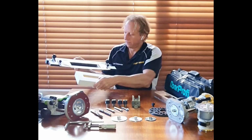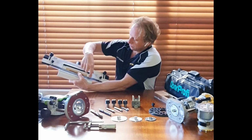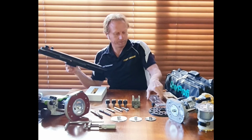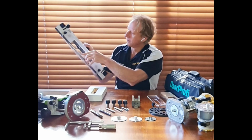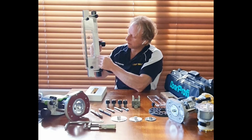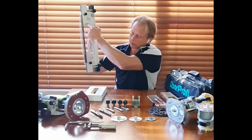Now that would go like that, and the template you use would be cut in the centre. So as an example, I don't have one here. If you're going to do the spindle holes or the cylinder hole, well, that's centre of the template, and then that works for 60 back set. So this rail here to the centre line of that will be 60.